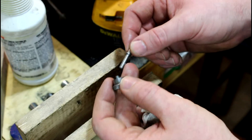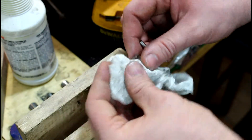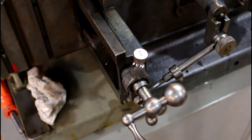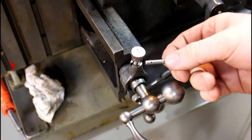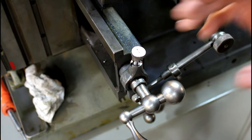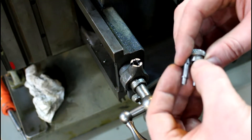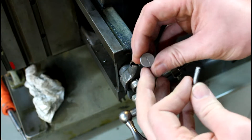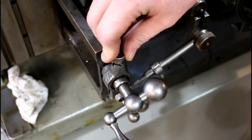Next I'm going to clean this off a little bit — there's a little shard on there. We've got to cut our cutting edge. I'm going to take some measurements and see where I want it, and then we'll continue on. The next thing is to figure out which way to cut our groove in. We want to make sure that our slot is parallel with our hole, because then when we go to use our arrow, our arrow will be lined up.